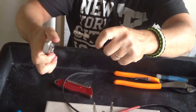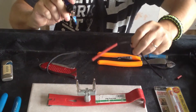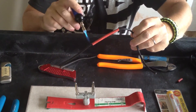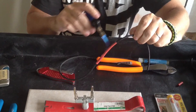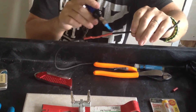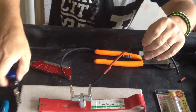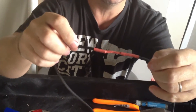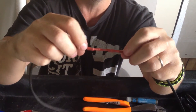This is where you can actually use a heat gun to shrink this tubing because it doesn't take a whole lot of heat to do it. If you're using something like this torch, just move it back and forth real fast — you can actually use a little lighter to do this with also. And as you can see, it shrunk around it pretty good, so it's got a nice good seal on it and no water is going to get in there.